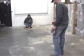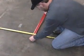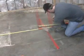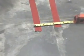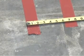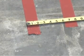In the shop, out of the wind and the weather, lay out a 20-foot template to build the sections of sealed insulation. Mark the floor 6 inches on either side of the 20-foot marks to allow for tabs to seal the ends of the 6-mil plastic sheeting.